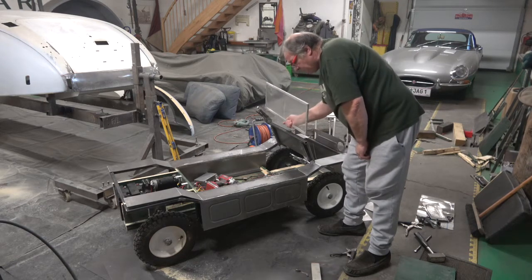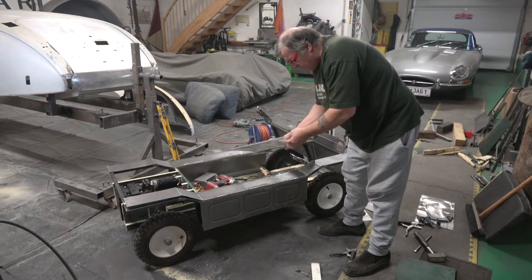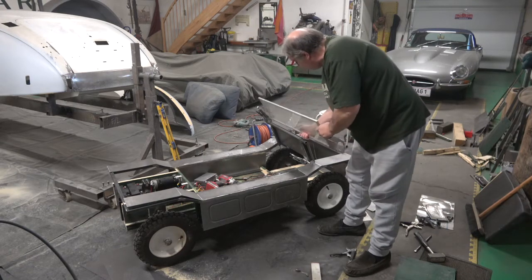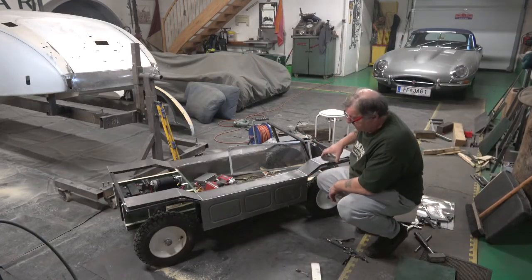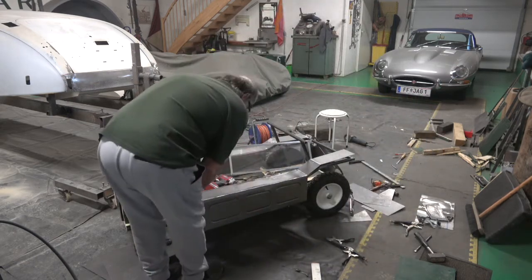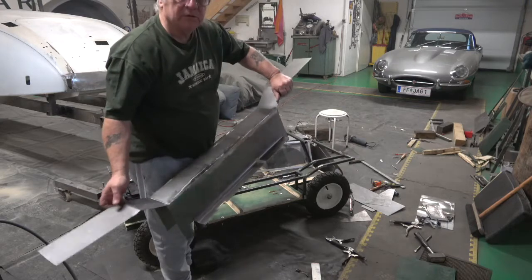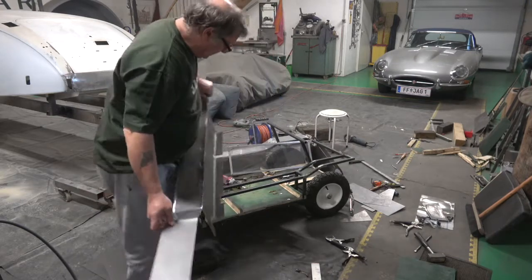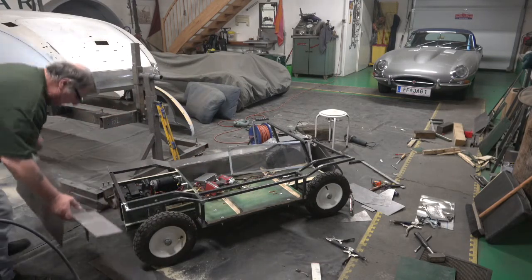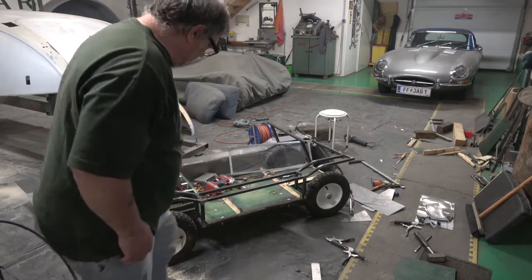So that when we're transporting it, I'll have to put a screw in the middle to hold it. It's a little bit of aluminium — all I'll do is cut it down, all this comes off. You can see I've done it inside so it's got a return, it's got a little lip on it there. And you can see how it's bolted to the base plate — it's bolted straight through here.